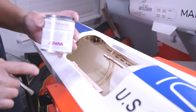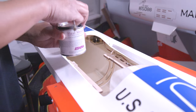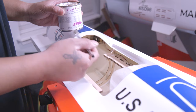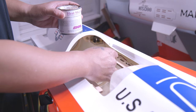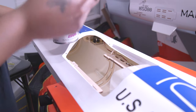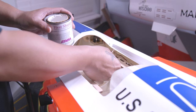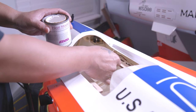What we have here is BVM Heat Shield Plus. You just take an applicator brush — I got mine from Harbor Freight, you get about 50 in a bag for only $2. All you need to do is put two light coats of this around the wood former. I'll probably put some at the back end where the exhaust tube is as well. Apply a light coat first, give it about 10 to 15 minutes to dry, then put your second coat — that should be enough to protect the wood former.